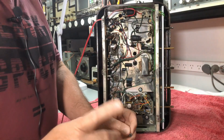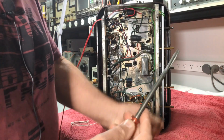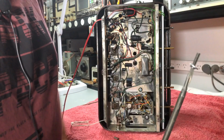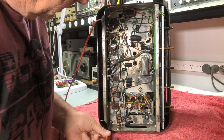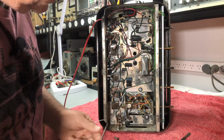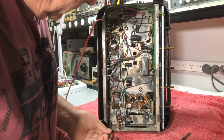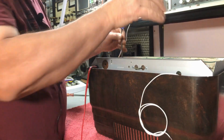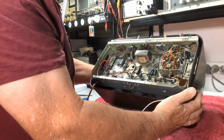Now, as I've showed you this before, split screwdrivers, split blade, put him in. Push him up, and it's a wonderful thing to be able to hold on to slotted screws. Now, I don't know whether you can still buy these screwdrivers. They are absolutely brilliant for this old gear. Obviously, not needed for Phillips anymore, but for slotted, they're brilliant. Don't over-tighten screws into Bakelite. Word of advice.